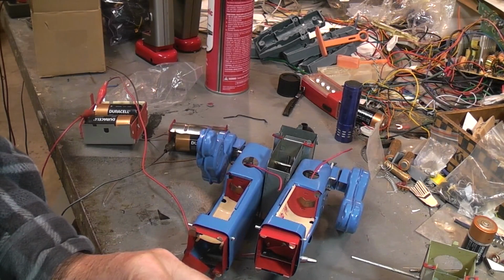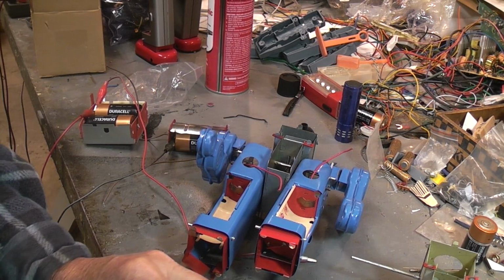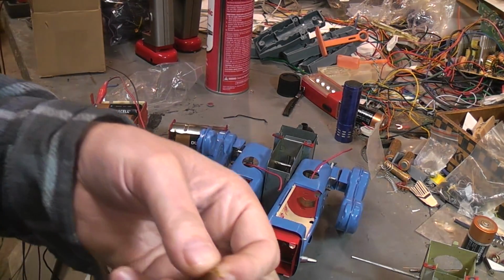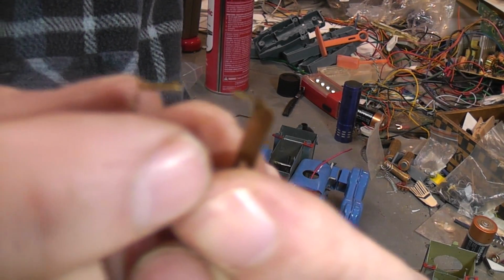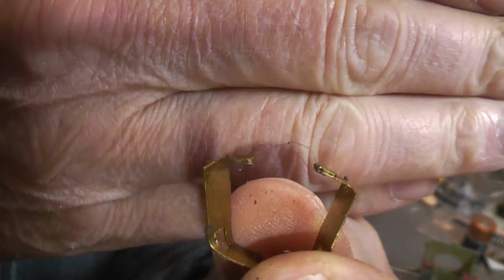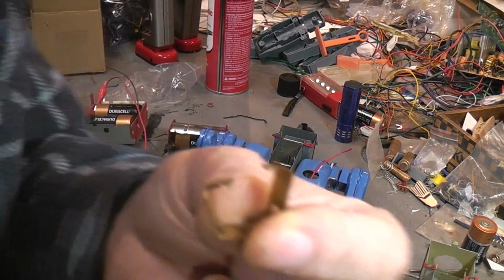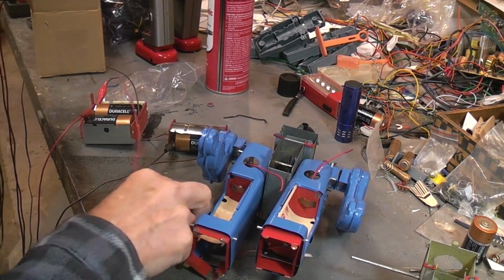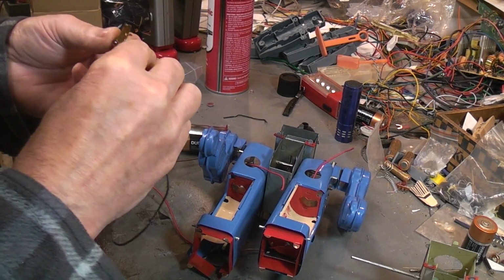It's a heating element wire. It's a Constantan wire, very small gauge. In fact, I bet, because I can't see it with my eyes, there is a wire between those two. They are held together. I don't know if we can get it to focus. See that little wire? That's the heating element in one of these. In fact, let's try putting 3 volts to it and see if we can get it to glow.